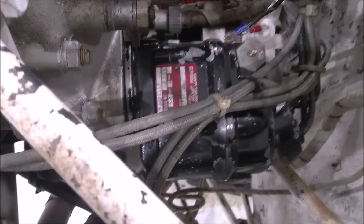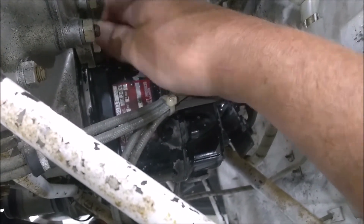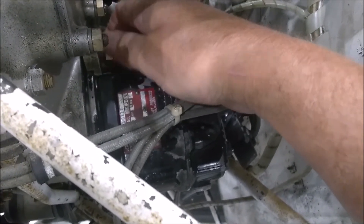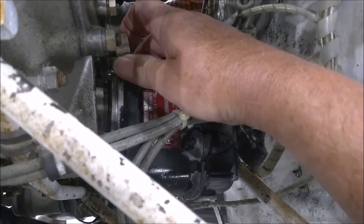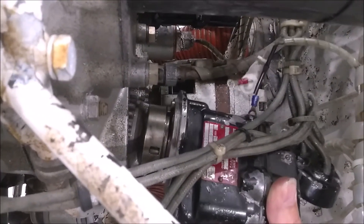The P lead is off and the ground is off. This is just on there loose because I loosened them up. You definitely don't want to drop your mag on the floor. There's the nut - I already took the star washer off. Now let's grab my mag. That's one of two mags off. Now I just got to go over to the right side and do this one.